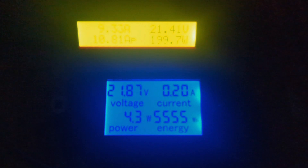What I was going to say is the orange cheapo budget controller that I'm using — I found out the other day if the voltage goes below 18 it switches off. Which is very strange because when you're drawing a load, it doesn't switch the load off, it just switches the controller off. So whatever you've got draining the batteries will keep draining them and nothing will be coming in. And there's no chance of the batteries going back over 18 unless you turn the load off.